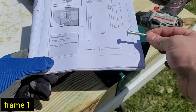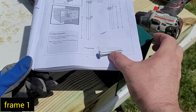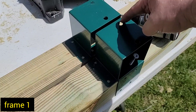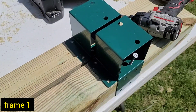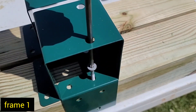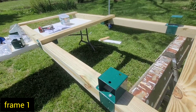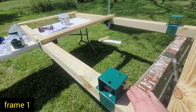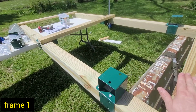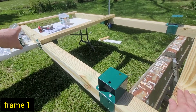To put on our first set of brackets, they want us to use the two-inch lag screw. For convenience, they put an exact size replica inside the manual so you can match it up. We're only putting two screws in — one through this hole on each side. We're using their driver bit, putting that through and tightening it down. Getting to the end of figure one, I have it laid out on sawhorses. I have two two-by-fours: one at the top and one in the middle, both four feet long, and a deck board that goes all the way across.